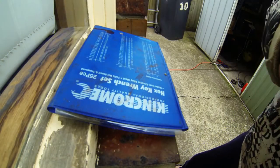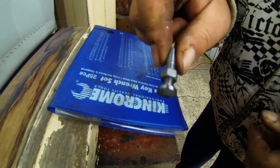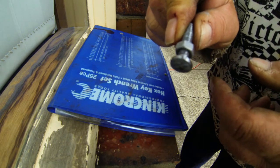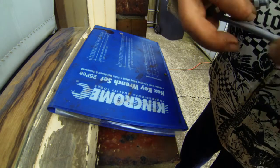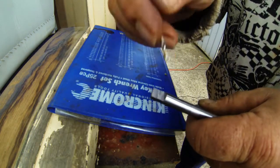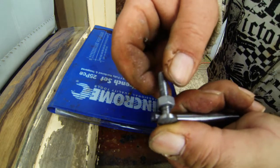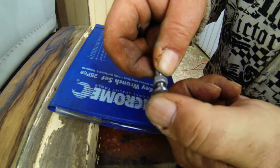I didn't film this part because it was just a slow process. I've cut out the little square block and made a bit of a relief. I've screwed the nut on and tried it. I'm going to face this off so that when it fits on the tool holder, I'll drill a pilot hole through there and put the bolt through so it sits in nicely — and the dial indicator will sit on this side here.